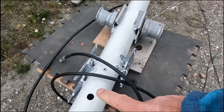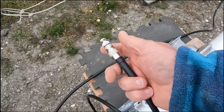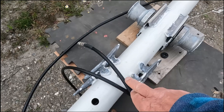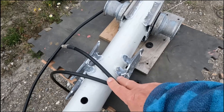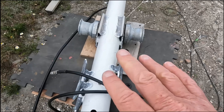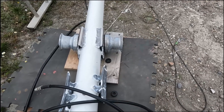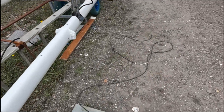I've still got to sort out the deck lands for these that are going to be large enough for the connector to be able to go through and yet be able to grip the cable. I'll probably put a bit of heat shrink on just to make the cable a little bit thicker where it goes through the deck land to give a nice tight fit. Where these cables run below decks will have to be in really good ducting because any time we take the mast off we've got to bring these back onto deck — there's no break. We have to disconnect them from the boxes, bring them onto the deck, and then we can take the mast down.